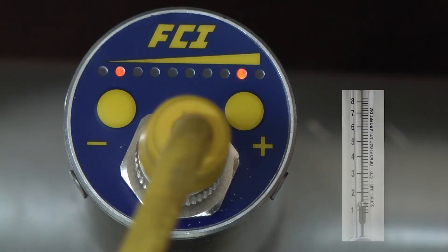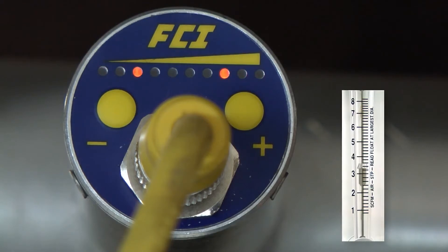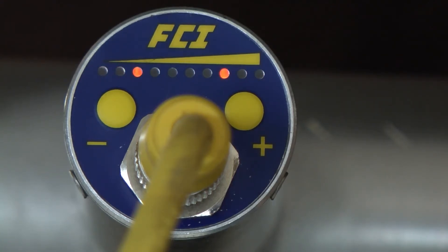In the case of liquids, it is strongly recommended the line be full with no flow before entering into this range capture mode. Then slowly throttle the valve to full scale. When applied to liquids, it is not uncommon to saturate the signal before reaching the desired high flow. However, the FS10 will perform as expected over the usable range set by this process.